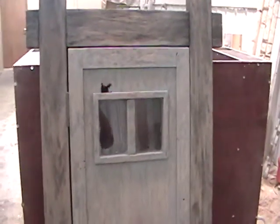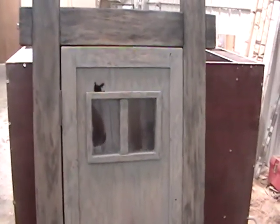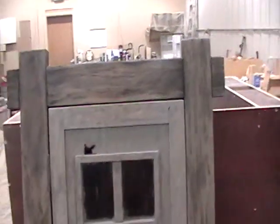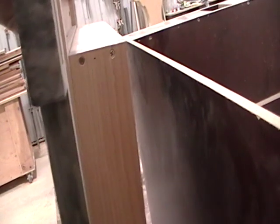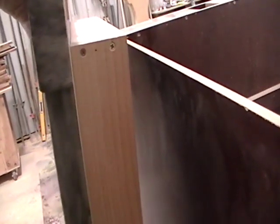The other option is, if you want it totally blanked out, to put a little door on this part here on the window on the inside. If you wanted to let some light in — if it's in a powder room or something of that nature — you could just open up that little door and it'll let enough light in. This is our patented design, so the jamb extends all the way to the window, butting right up to the window frame itself and covering up the drywall head and sides and bottom.